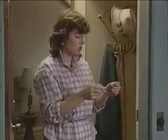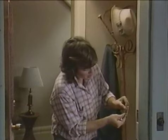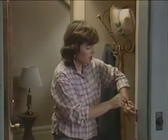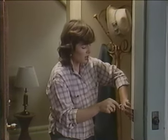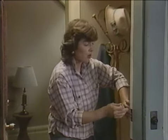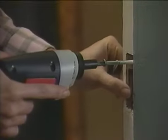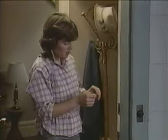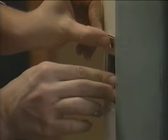Next thing we want to install, which is the first course of our three-part assembly, is this heavy-duty plate. Now, we've got large screw holes right here that will take these long 3-inch heavy-duty screws. We want to place this plate so that the screw side is to the door stop. That way we'll be sure when the screws go in that they're not going into the trim or the sheetrock and going into the substantial part of the 2x4 behind the door jamb. Our final layers will be our metal liner, fits in like that, and then our final finish strike plate, which goes on top.